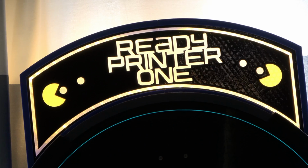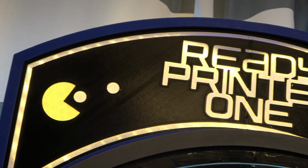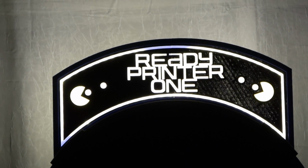The other part that turned out even better than I imagined was the marquee. Made by doing 2 color filament swaps during printing, the details came through really nice. I started off by printing clear filament, then switching to translucent yellow, and finally ending on black. Despite the fact that there was almost no surface contact to glue the two halves together, 3D Gloop managed to bond the two halves together and have had absolutely no problems since. The marquee is backlit by a simple 12-volt LED strip and it glows really nice. Also, it gives the lettering a Pac-Man pellet feel, which was totally intentional if anybody asks.